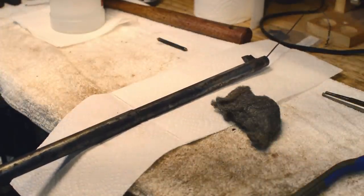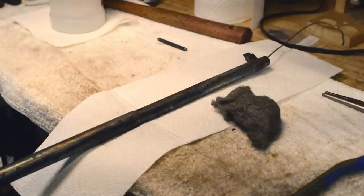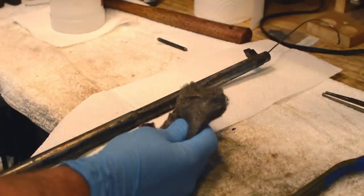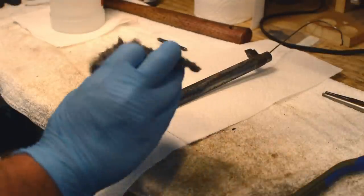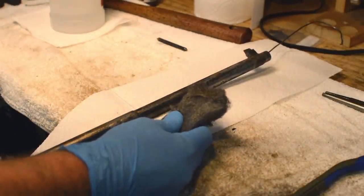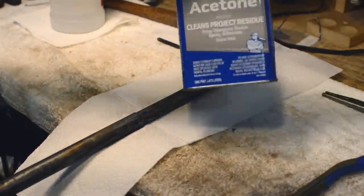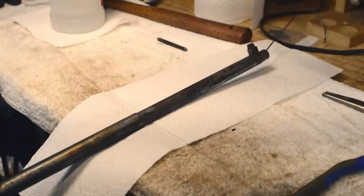But carding is merely rubbing off the loose oxide off the metal with either a wire brush, as we did earlier, a wire wheel, or as I'm going to demonstrate here, just plain old degreased steel wool. And I think this is like 3/0 steel wool, just like you get at your local hardware store. Just make sure that you get some acetone and do 3 washes of acetone and dry that steel wool out, because steel wool comes packed with oil on it from the factory.